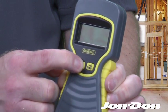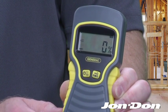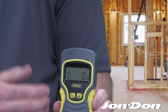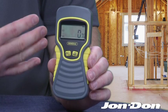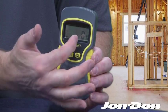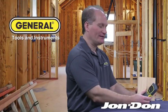What you have here is an on-off button, and the unit automatically calibrates. Once it's done calibrating, you're able to measure your substrate. The back end of it is what you lay down on your substrate. In addition to wood, you can also read drywall, carpeting, and harder substrates like brick, concrete, and tile. On the right-hand corner, you have your battery indicator, which gives you your high-low battery level.